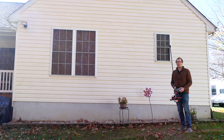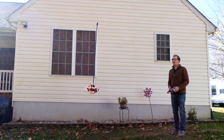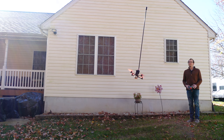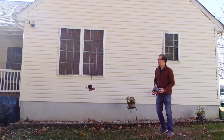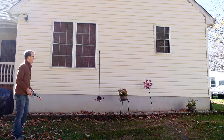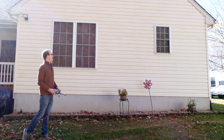It only took a little bit of tuning to get it flying reasonably well, and I can essentially control the position of the drone just through changing the desired pendulum angle, and I'm doing that part manually through my radio. The pendulum controller itself is just managing the pendulum angle, and it's pretty good at rejecting disturbances, as you can see. I'm sure I could tune it a little better, but I was pretty happy to even get it working this well, and I didn't want to waste too much time perfecting it. It's clearly not perfect, but that's okay.